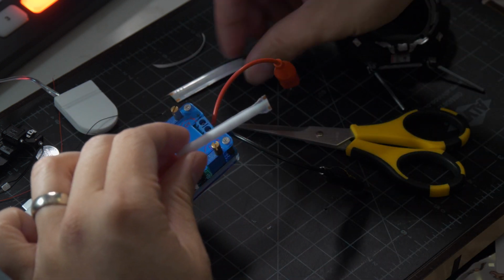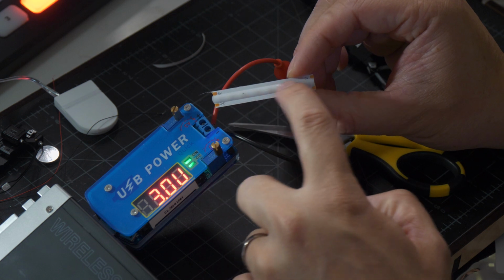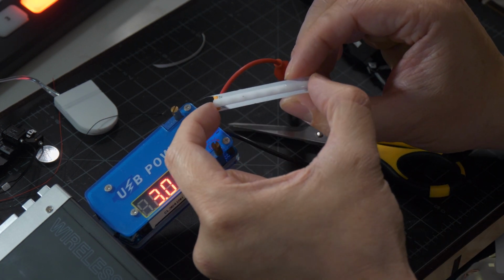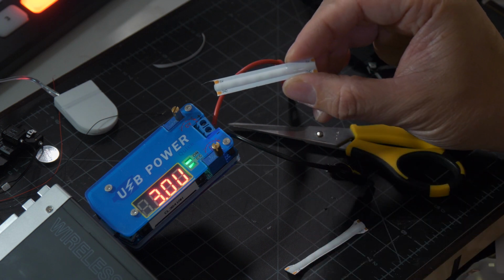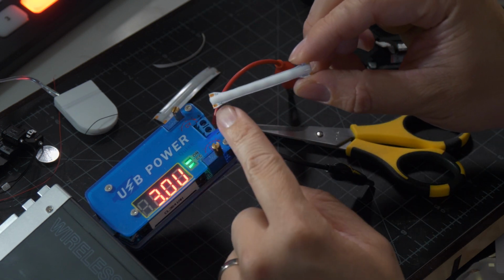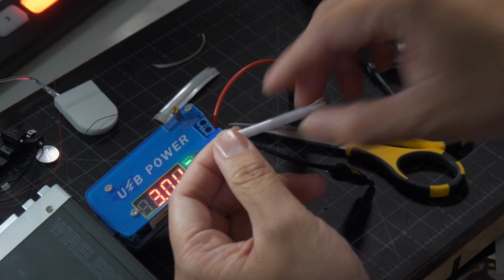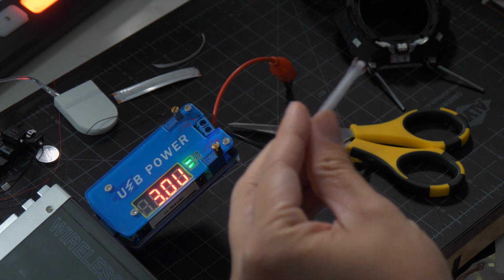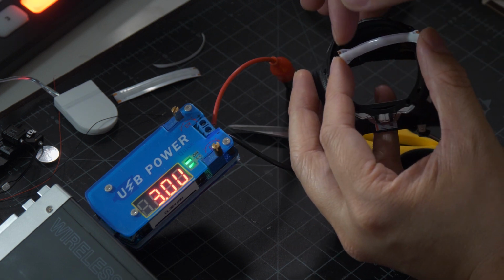Okay, so I didn't know this. This is really neat. Normally, the COB LED would be this thick. So this silicone part in the middle, that's what's illuminated. You can actually see the tiny bits up close of the spacing of the individual diodes. And this is the shortest length you can cut it to have the exposed contacts, but I don't want this top and bottom part. I don't want that white part. So I was thinking I could use adhesive on the back and just mask it, hide it with some electrical tape or some gaff tape, but I cut an extra length and just using a pair of scissors, cut out and trim this down while leaving the sides wider. But that then took this from, I think, an 8mm thickness to just under 5mm. That is fantastic. It makes this much lower profile and makes it possible to fit it into the back collar. But I'm going to first solder. Let's get some wires in.